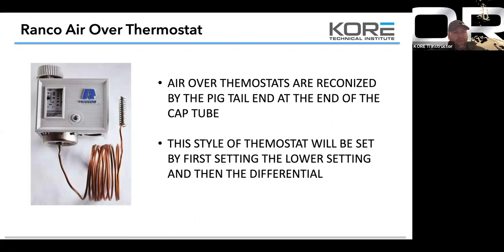I can't tell you how many freezers I've been out on, even as of late, where we have icing on the ceiling and we have drips forming and stuff. And everybody thinks that that's infiltration, or we got an air gap somewhere. No, they're propping the door open, number one. So we have to address that issue. But the second issue is that this isn't set correctly. So let's make sure that we're checking the settings on this.